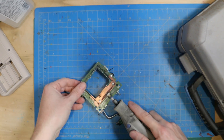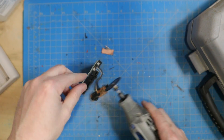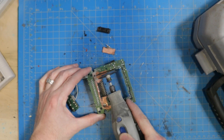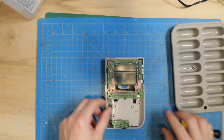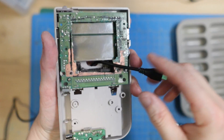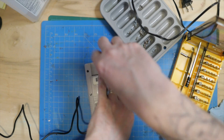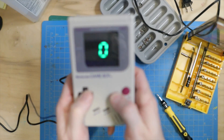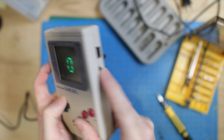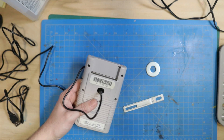I needed to cut out part of the plastic where the cartridge goes because it was in the way of where the power cord comes through. After test fitting and making sure everything lined up, I put all the buttons back in and all the screws to hold everything down, plugged in the power cord — looking good. All assembled. The buttons still feel like they function and we retained all the input ports on the side, so it looks like an original Game Boy, and all we did was put a speedometer in it.